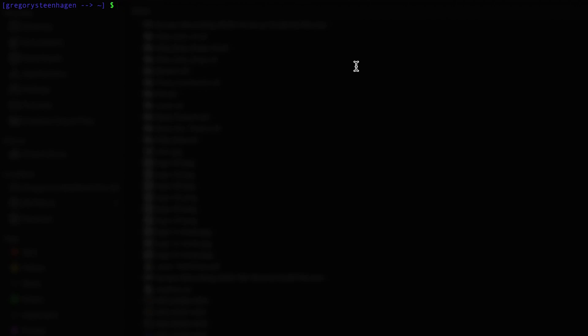When you boot your Raspberry Pi with the micro SD card, it will enable SSH and connect to your home Wi-Fi network, allowing you to complete the rest of the steps with no keyboard or monitor connected to the Pi. With the Pi all booted up, you can verify if it connected to your Wi-Fi by accessing your router's configuration portal. Once you have the IP address of your Pi, you can go ahead and SSH into it using your favorite SSH client. I'm using a Mac, so I'll just use the terminal application with the username Pi and password raspberry, which are the default credentials for the Raspbian operating system.